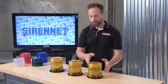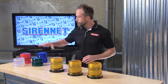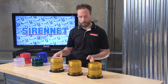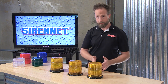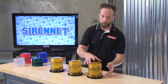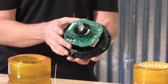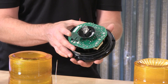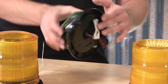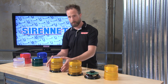Same footprint. Same heights. These are the high profile dome — you can also get a lower profile. So depending on the height you need to meet, select which one's needed for you. Both can be flat mounted — all three can be flat mounted or standard pipe mounting. Whelan Engineering hasn't modified anything from the original 2022 in the way it could be multi-purpose mounted: flat mount or, on the bottom, one-inch standard pipe threading. Because the base assembly has stayed the same, that's the same thing in the L10 and the L21.